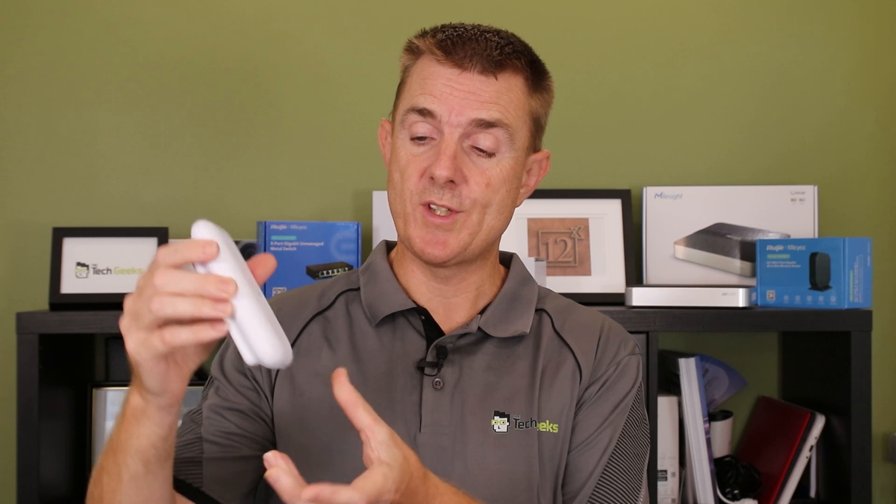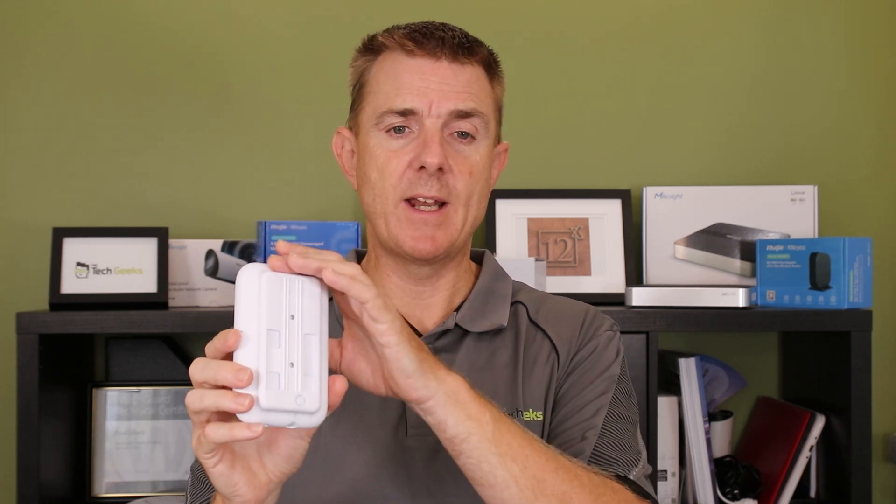So what is this? It's a WiFi 5 device — it can do about 300 Mbps in 2.4GHz and somewhere around 500 Mbps in the 5GHz frequency. The design idea is for it to be versatile. Firstly, it's really small, which I like. There are some new mount options coming in due course — a little desk mount is coming, and like I said we've got mounting for pole, ceiling, and hard surface. We also have some expandability with the antennas, which I'll show you in a moment.